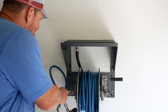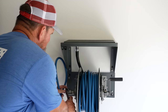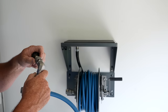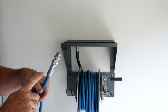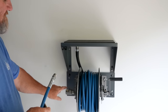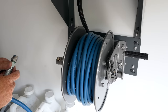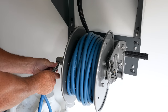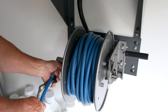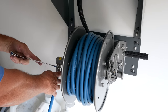There is a little plastic protector down in the threads - you may have to dig it out with a pocket knife or something. You'll have two ends: one end is an M22 and a quick disconnect with an elbow, and the other end is a 3/8 by 1/2 reducer - that's the end that you'll screw into the actual hose reel itself. Be sure and put a little bit more Loctite on here; this uses the same 7/8 wrench. Get it started hand-tight first, thread it as far as you can with your fingers - we don't want you cross-threading it - then tighten it down with your 7/8 wrench.